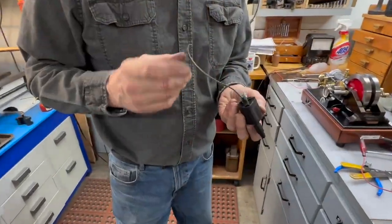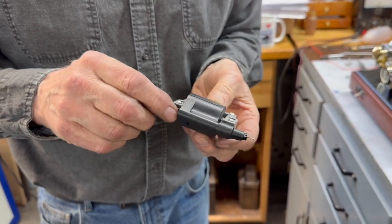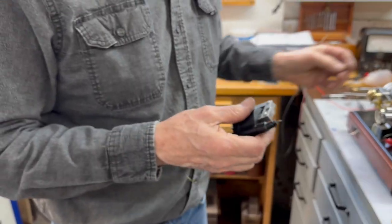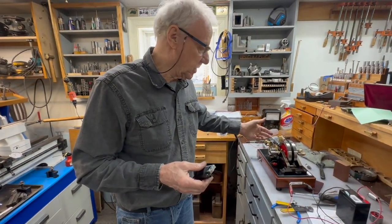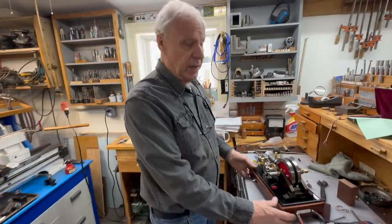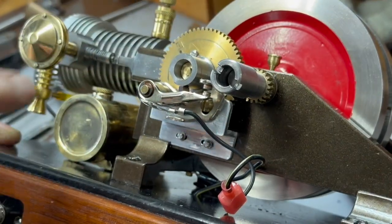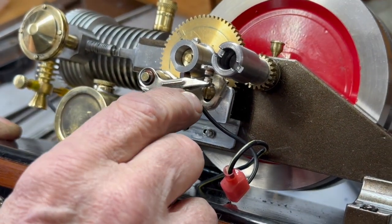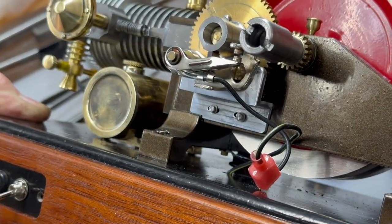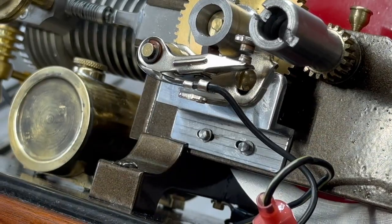So after blaming the spark plug, we found that this coil had an internal arcing problem somewhere. If it has any resistance at the spark plug, it'll arc internally and won't run. If you put the spark plug out in open air, it gives a good spark, but the minute you put it in the engine it won't fire. After all the experimenting — even installing points and a Hall effect — we find the coil was bad the whole time. You can see that the points look pretty clumsy on there, and without the bad coil you don't need all that extra bracketing.